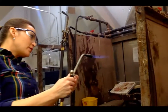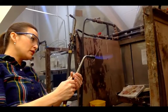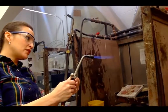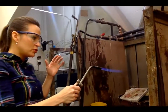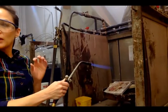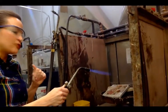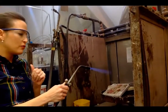So I've got a six-inch flame. If you want to make it more pointy, sometimes you'll need a little bit more flame — that's a little bit stronger. Sometimes you need it less pointy. What I'm going to do to these two pieces of metal is annealing, which makes the metal more malleable and ductile so that you can hammer it, texture it, and bend it. And then I'm also going to show you how to fire scale, which is just sort of painting the copper with flame.